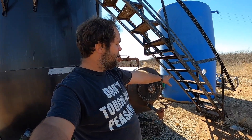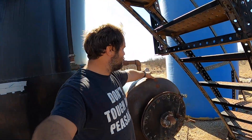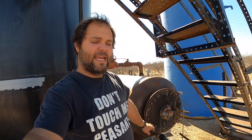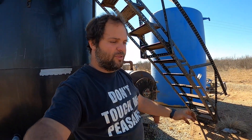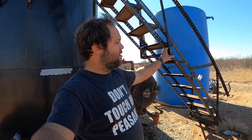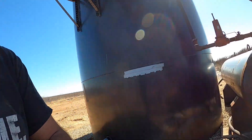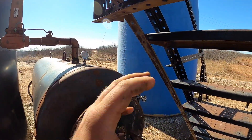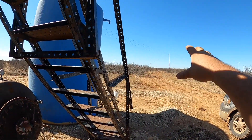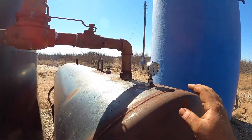Right now the tank is empty, so it would take literally zero pounds to push it there. But if the tank was full, it would take probably three or four psi, and you want a little more than that — you don't want to run right on the ragged edge. Some places our water tanks are a long way away from the separator and you've got to run 20 or 30 pounds. But we like to run as little as we can get away with. The less pressure you run, the less pressure on your wells, the less likely you are to have stuffing box leaks. I'd like to have this thing hang out about seven or eight pounds.